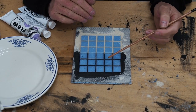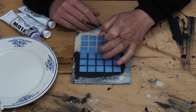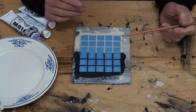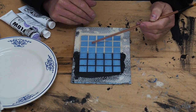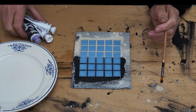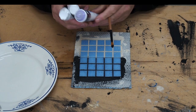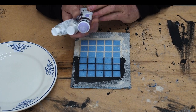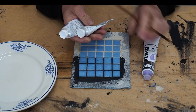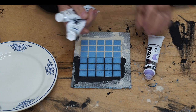What I've done is I've actually grouted two different colours on this piece of Marmox board. I'm sorry about the grout that's gotten into the pits of the tiles — that's why I generally don't use pitted tiles, because I find that's really annoying. However, because this is a sample piece I'm not going to be using it, so it's not an issue. Now what I'm going to do is try a few different paints and colour the grout after it's finished. Obviously I wouldn't do this for an outdoor piece — this is more for an indoor piece, because paints can fade. But for an indoor piece I haven't had an issue with them. I always use good quality paints with good pigment, and I find things like Golden work really really well, and Matisse.